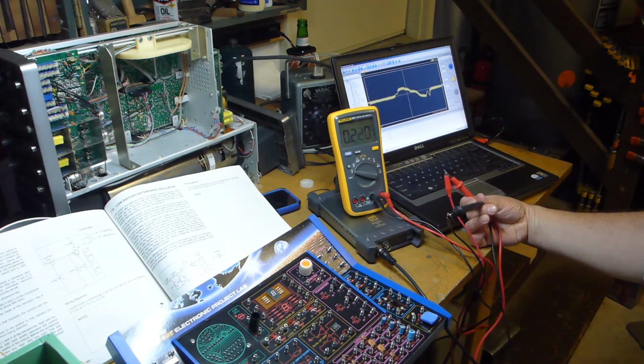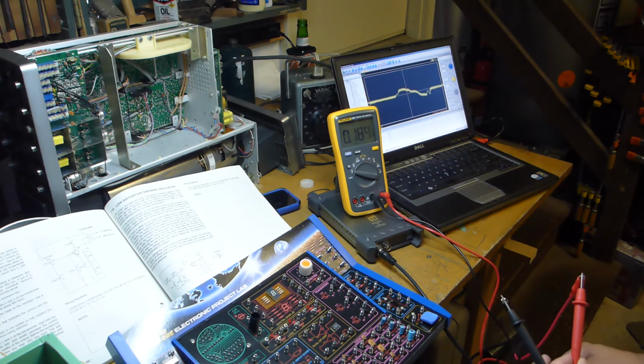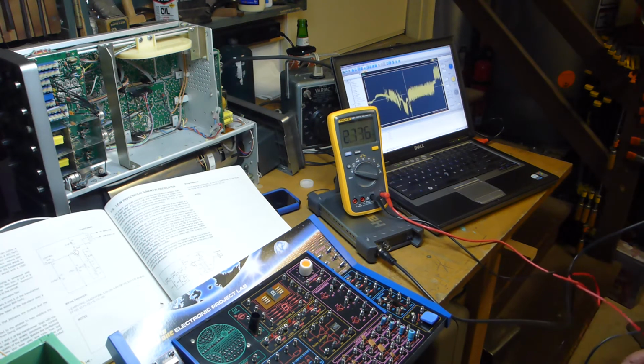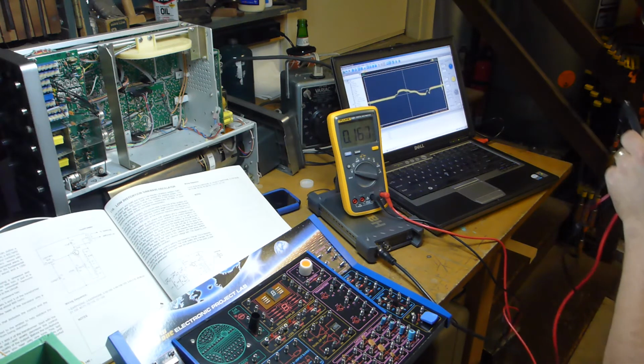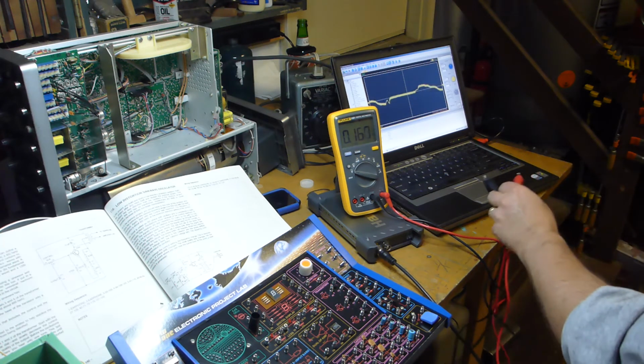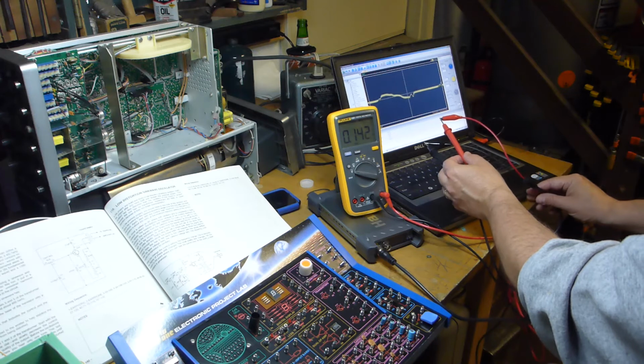Now, the Fluke settles on 0.2 volts. My RMS... crap. It wasn't that close before. It was, in fact, really far apart. Now it's looking really close. Things change depending on where you move it around, picking up stray inductive currents and whatnot.